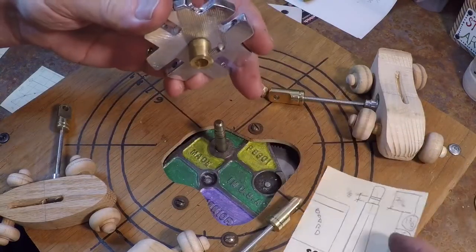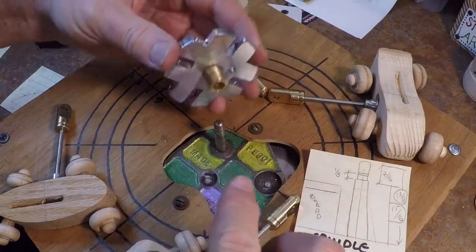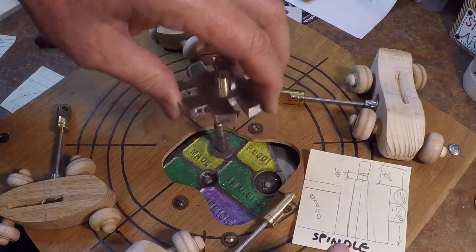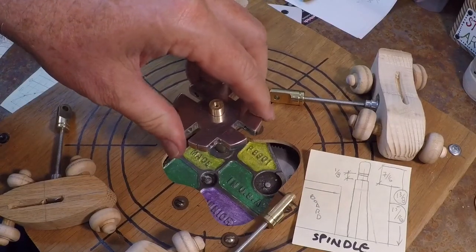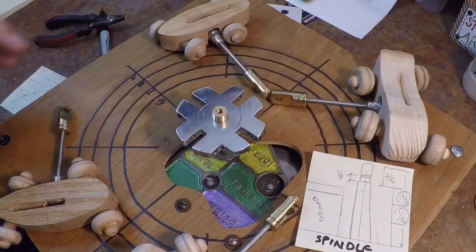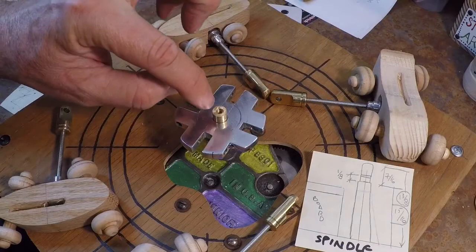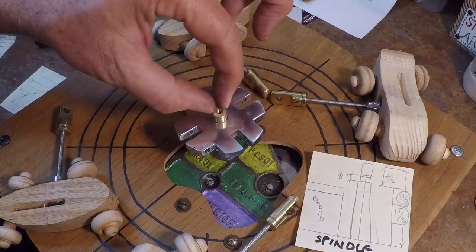What I did was cut a little coupling out of brass with a set screw, and this thing goes over the top of this piece. It has about a one or two thousandth inch over-tolerance — just slightly bigger than the shaft — and it actually takes a fair amount of force to get it on there, so I'd call it an interference fit. Then I cut the aluminum piece to go over the top of this, with a set screw that ties the aluminum to the brass.